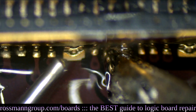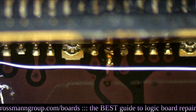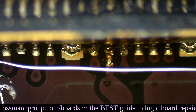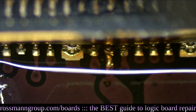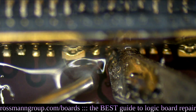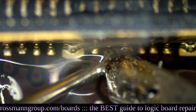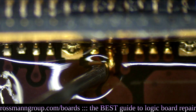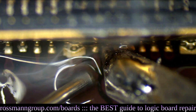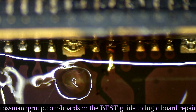Now I'm scraping. Jessa Jones says scraping is raping — that was her catchphrase. But I'm going to scrape here because I want to remove the conformal layer from the board. I also want to remove any of the junky, corroded nonsense that may be left behind on top of the copper layer, so that when I solder the pin on, I get a nice connection.